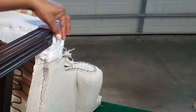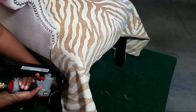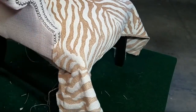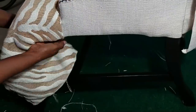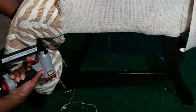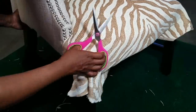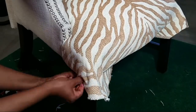Once that's done, make sure all of the areas are tucked in neatly. We trim away the fabric on the sides — pull it snugly with your pliers and staple them underneath the chair. Whenever I window shop, I always look at how things are made that I'd really like to own. I noticed that a chair I had my eye on had just a simple fold right there around the front band — the fabric was just folded down. So I'm going to try that: cut away the excess fabric and tuck the fabric under itself around the corner.